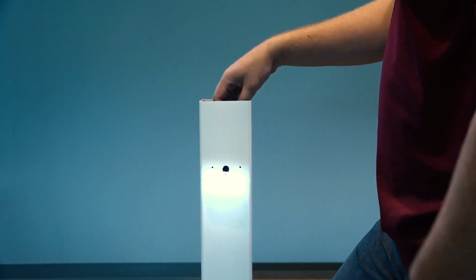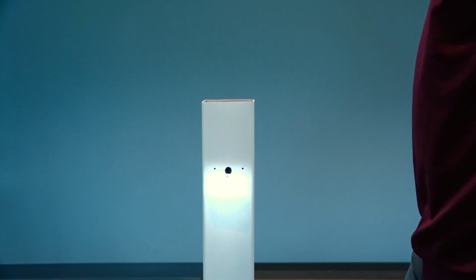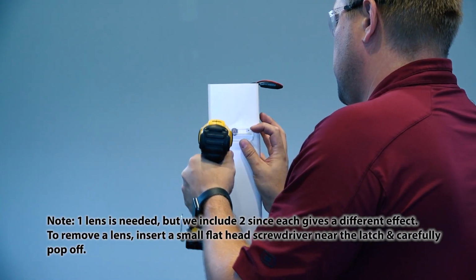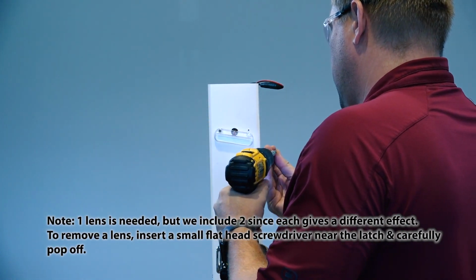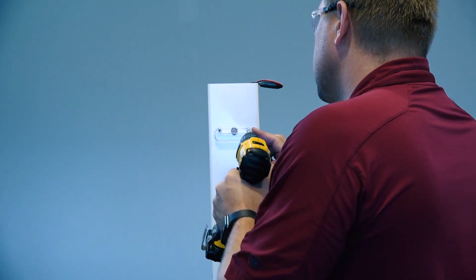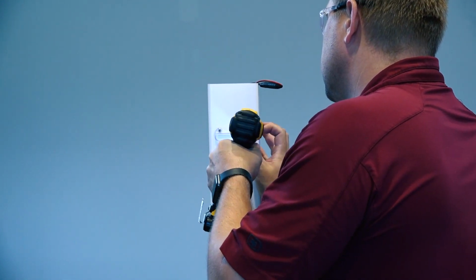Push the wire and connection back through the 1/2" hole until the back of the lens is flush with the post. Use the 2 included stainless steel screws to mount the lens to the post. Then align and snap the cover of your choice onto the lens.